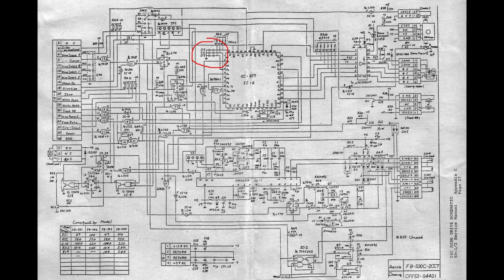Now, how can I make this drive step to the half track positions? Well, one possibility is playing with these jumpers that, however, are not documented in the service manual. Since this controller is the same used on the quad density 80 track versions of this drive, probably there is a jumper configuration that makes the CPU step each half track in response to a step input from the interface, as if it was an 80 track drive. However, such a modification would also require me to modify the Commodore disk firmware to produce direction and step controls instead of the 2-bit step sequence that we have seen.